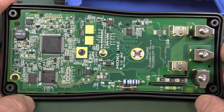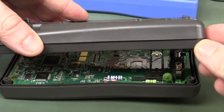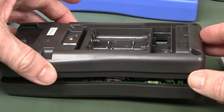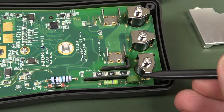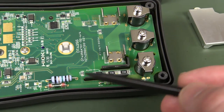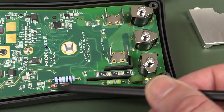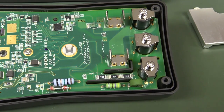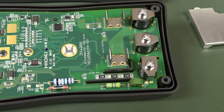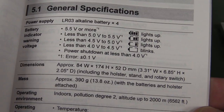So that is certainly a very well designed, neat and tidy, well-manufactured bit of kit — thumbs up. Check out the really deep grooves they've got on there for blast protection around the outside. They're doing everything right. As far as input protection goes, they haven't really gone overboard — they've got one PTC in series and one gas discharge tube, but no MOVs. A GDT performs the same function as a MOV though, and it looks like a really schmick expensive one. It's no doubt meets the Cat4 IEC standard for this.